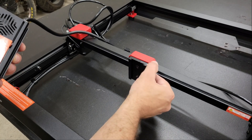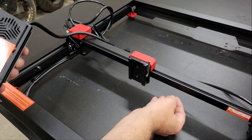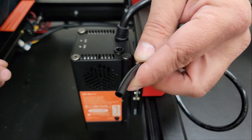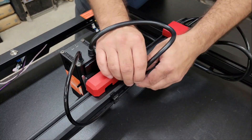The module is connected to the gantry by a cam lever that opens and closes the dovetail groove that the module slides into. After the module was installed, I connected the tubing for the air pump and secured it with the wiring harness using the clips that are mounted on the gantry and a few zip ties.